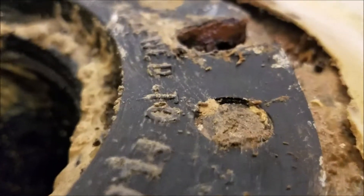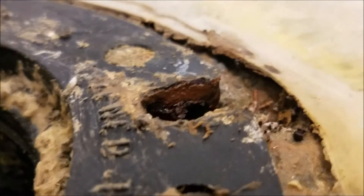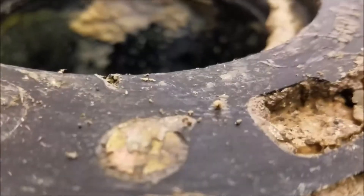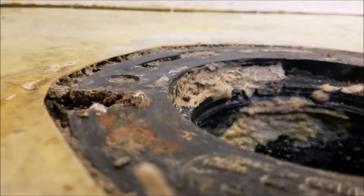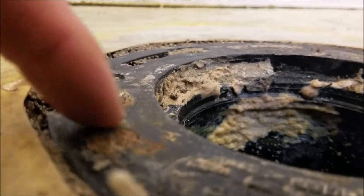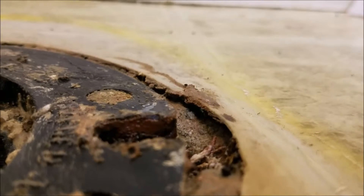These non-adjustable flanges are great because you've got a half-inch full-thickness flange. They're solid ABS, which is better than PVC, which is very brittle as it ages. This one holds really well — it's anchored in, I can see they've got the brass screws in, it's concreted in, so that all looks good. My only thing I need to point out before we get going is you can see it's been over-tightened just a little bit — right in this area here where you see where the bolt comes in on this side, not so bad, but it does balloon up right here because it got over-tightened. This one is pulled up even further.